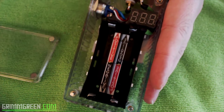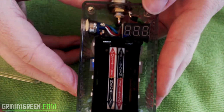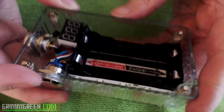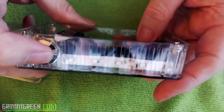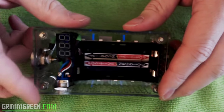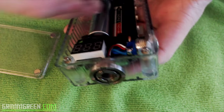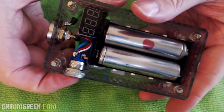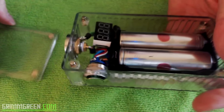The 510 connects to the switch. If I pull one of these batteries out you can see it's a pretty basic sled — positive, negative, positive, negative. This is series, not parallel, so you have to put one negative this way and one negative the other direction — you flip the batteries around, kind of like the Sigelei 150-watt. There's a lot of space in here around the sled, with LEDs in here like crazy. There's nothing protecting the switch from the amp or battery load, so I'm not sure how long this switch is going to last. It's been working for about two months now.